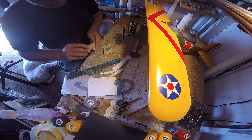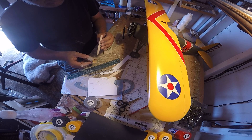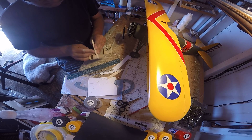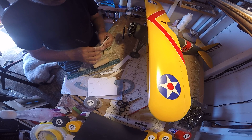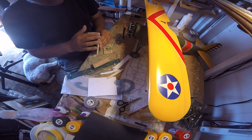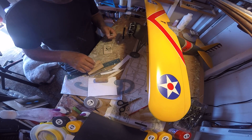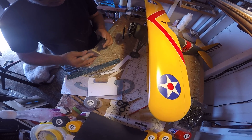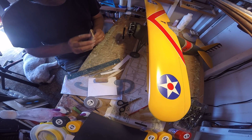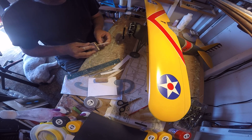Get rid of these edges. Any time you see a hard line in the light, you want to just take it off, remove it. So: back edge, front edge. Leading edge of our propeller. Trailing edge of our propeller. Taper of our blade. Hollow of the back face. Rounding out of the front face of our propeller. And back and forth we go, round and round. Knife edge. Rounding.